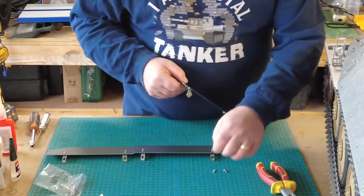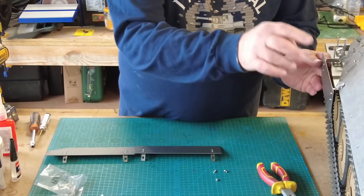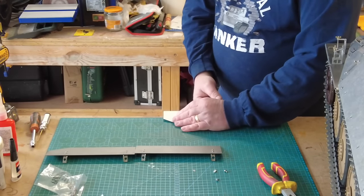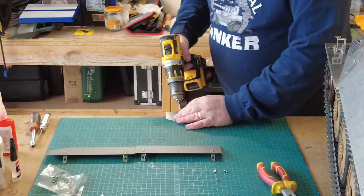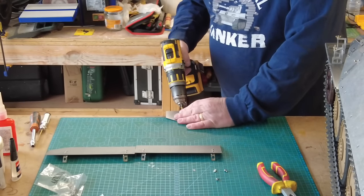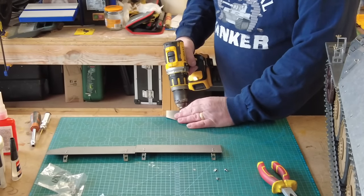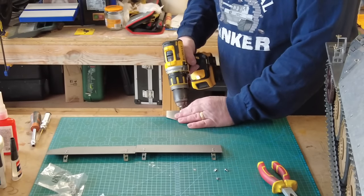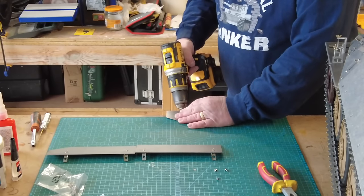Now if you're going to install these and put the fixings through here ahead of this, you don't need to do this, but I think this is probably the easiest way to do it. So I'm just using a cordless drill, and it's actually a 5.5 mil diameter bit, and it's just small enough to pass through that hole initially. And now I'm just going to use the drill, excuse the noise, just to slowly open that hole up. Just working the drill up and down